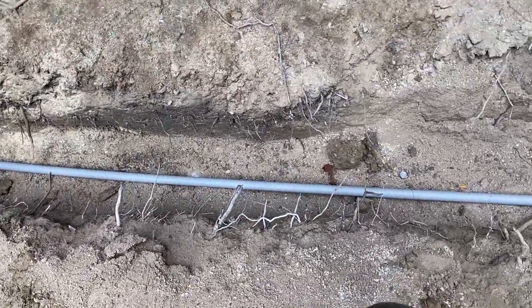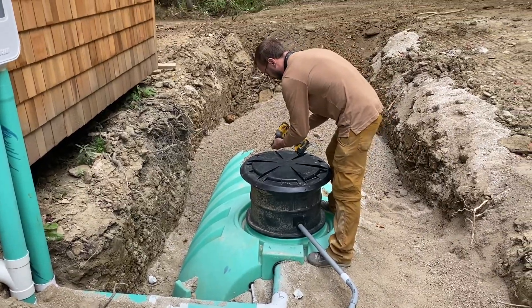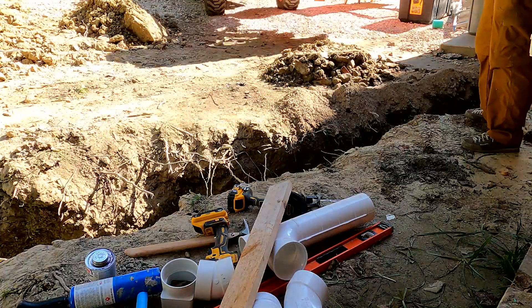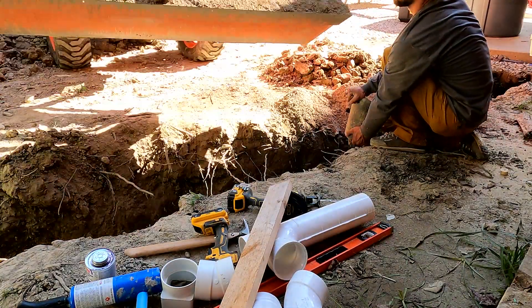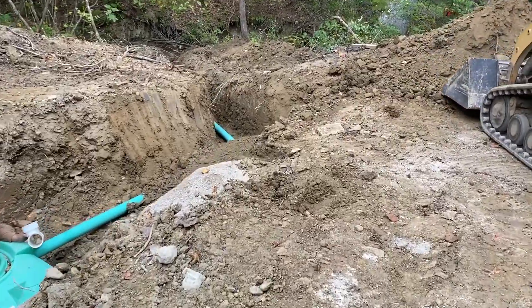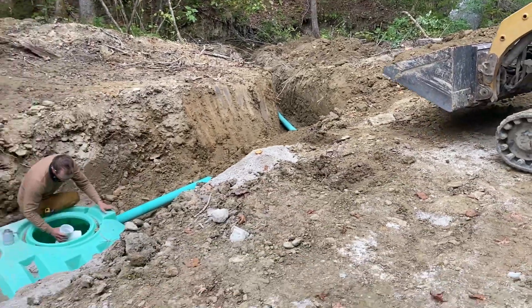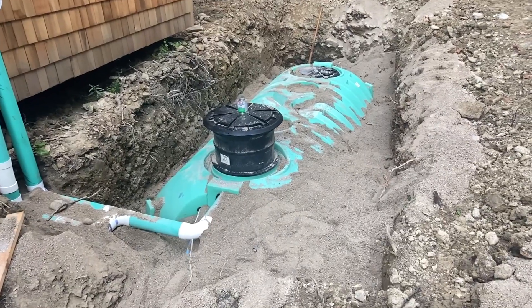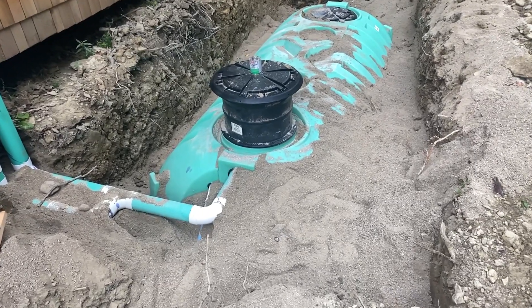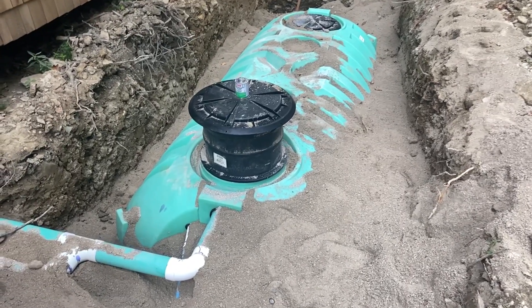At about a foot down, I took a one-inch electrical conduit PVC and put it from the side of the riser, ran it back to a box mounted under the deck. Then we went ahead and backfilled the whole thing on that side so we could get started on the overflow out the other end. The overflow is pretty straightforward — it goes on the other side of the tank, there's a hole drilled in it just like for the inlet, and it runs down the trench and out to the creek. Pete's installing a T there to help with the turbulence in the tank. Then we backfilled it with the rest of the sand — that really helps, so ground pressure doesn't shove a rock or root into the tank. It's got a little buffer all the way around it.